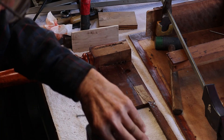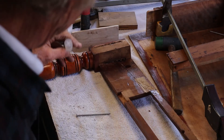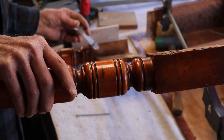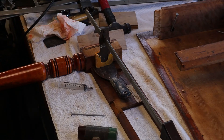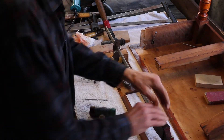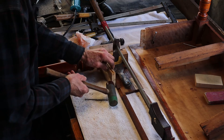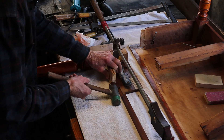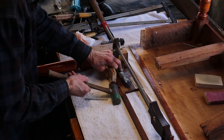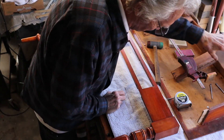Now one of those tricks will be the use of acetone. I'm going to fill a syringe full of acetone and insert it into where the putty knife was, and try to get it down deep inside that mortise to see if I can free up that tenon. This is the woodworm side that was damaged and I wanted to repair that before I attempted to take the leg off. Here I'm using a spreading clamp and putting some pressure on it and giving it some more taps, just trying to go gently because it's not very strong. It's been repaired before and it doesn't want to give up easily.